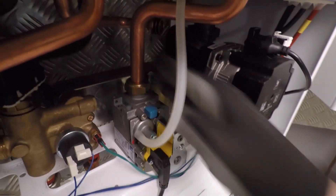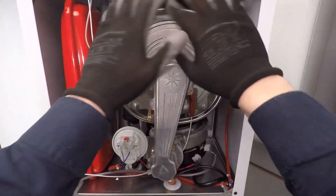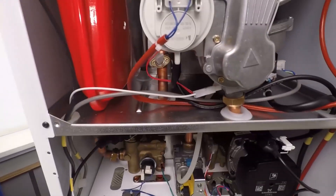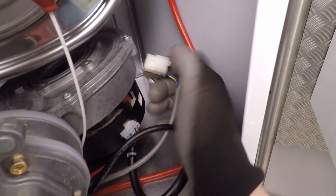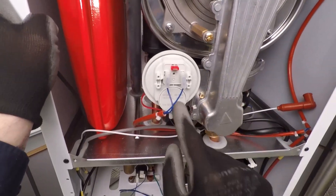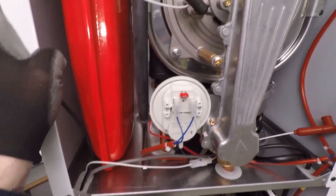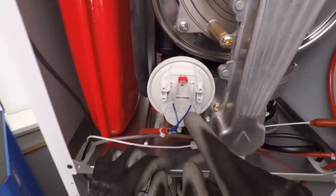You can see those O-rings as well - I'll make a reference to them along the way. Moving on up, we're now inside the combustion chamber. There's our main heat exchanger with the burner, the fan, and all sorts going on. First of all what we want to do is remove all of the electrical connections - the 240 volts to the fan, communication wires to the fan, flame sensing electrode. We can remove the spark and the earth. On this model we've also got something called a flue proving switch - if your flue blocks or your condensate blocks up in the winter you're going to get a fault code of E28.